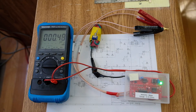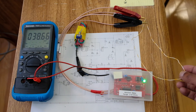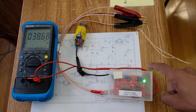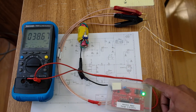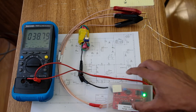Once a real resistance is placed in circuit, the true resistance can be measured. If the ~0.5 milliohm or less residual can be ignored, this is a fairly good measurement. Here is a piece of wire roughly a foot long — not very thick — with a measurable resistance on the order of 38.7 milliohms, which is fairly stable. One improvement would be to only sample the output when the offset calibration switch is not active, though even without that the output remains stable once the offset is held on capacitor C1.